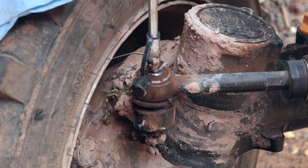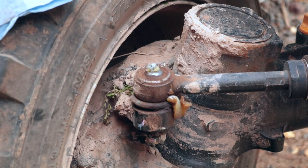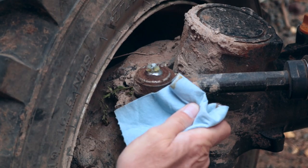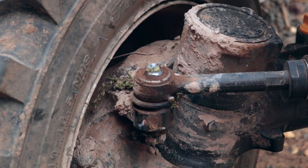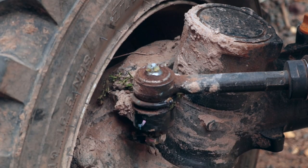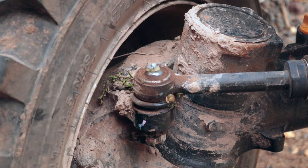But take that same machine and cycle multiple different guys through it, and at 3,000 to 3,500 hours that machine is hammered. You can see I'm pumping grease — it's a little dirty, there may have been some muddy water in there, and I'll just keep pumping that out until it comes out clean. The reason is that a guy who runs the machine every day knows how it sounds, how it smells, what vibrations are good or bad. When something's different, he's aware right away and can take preventative measures. A guy who doesn't know its personality will overlook problems, and the machine just doesn't last as long.